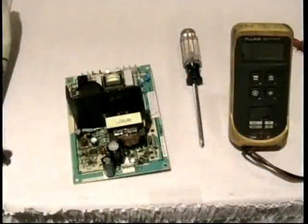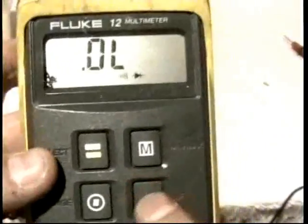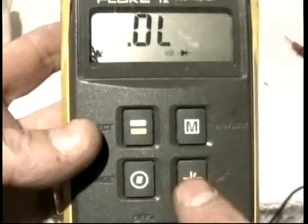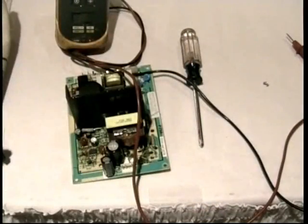Capacitors can test perfectly okay with a capacitor meter. For example, this Fluke meter has a capacitor tester on it that measures the number of microfarads in the capacitor. And again, I'm sorry, I wish we could spend an hour or two on capacitors, but we can't. It's not very reliable. There are a couple of different things that can fail on capacitors. One is it can lose microfarads, but the other is that its ESR, equivalent series resistance, might have increased.